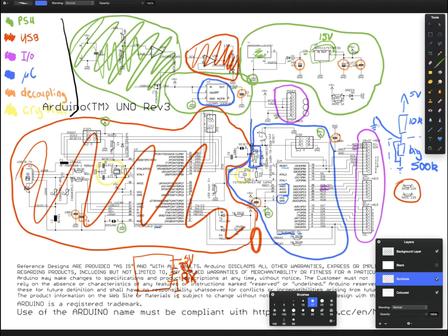And then when we take this away, which I can do like this, then all's good again. It should got 5 volts up here. Most of the voltage should go across here. Reset is high, and we're back to business.